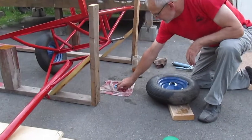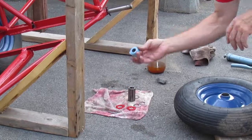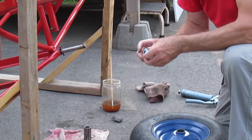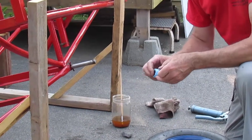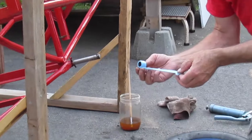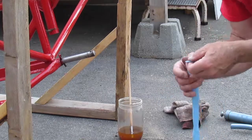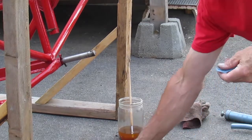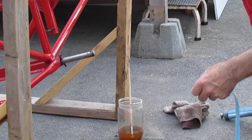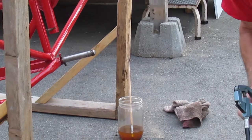We're going to have to put in a washer at the other end, and then we're going to have to put in some packing to stop the bearings from getting dirt and dust in amongst them. I didn't have the proper packing, so I'm going to make one here out of just a piece of felt. My daughter loaned me some of her art supplies. So what we're going to do is take this piece of felt — I cut it to approximately the right length for the proper diameter when we finish up — and we're just going to take the grease gun here and get some grease going.